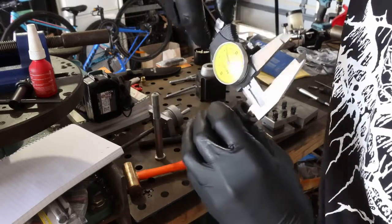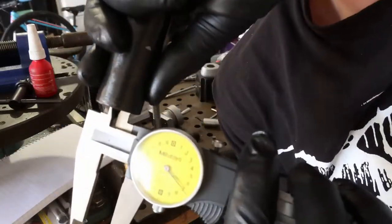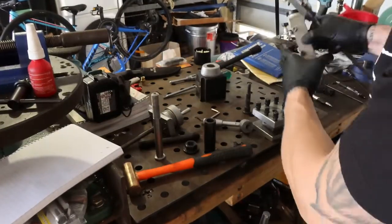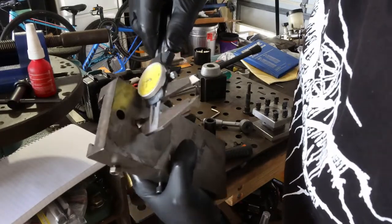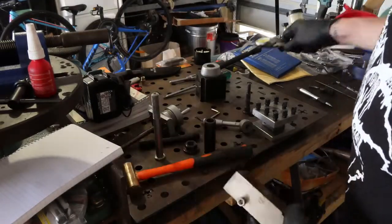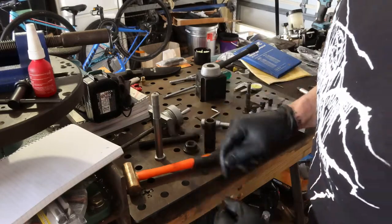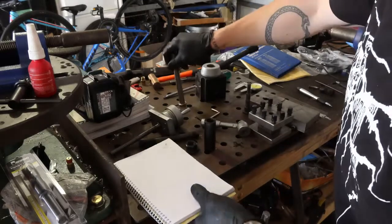We're going to check the inside diameter of that registration sleeve — that's sitting at about 16.7mm. Now the bore on the compound is 16mm, which actually becomes an issue: with the registration sleeve being larger than the bore on the compound, any stud which fits in the compound is not going to register nicely with the sleeve. So I will go through and recreate that sleeve also. I've run a file over it and it is not hard — it's as soft as it can be.